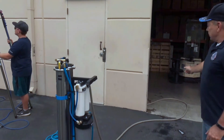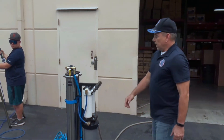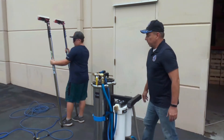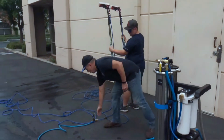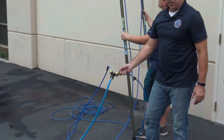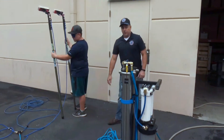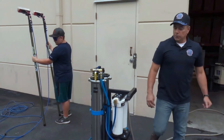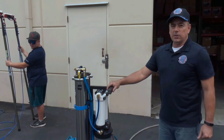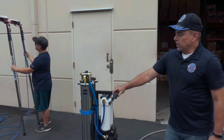This system is hooked up to this building at about 48 to 49 PSI, with a hose going to two water fed poles. I've got a Y adapter on the outlet, which gives me the capability to have two poles running off the same line. We're going to demonstrate the performance of this unit at tap pressure running a single pole and a double pole setup with four jets in each brush and a rinse bar on each pole, so it's going to have a ton of water flow.